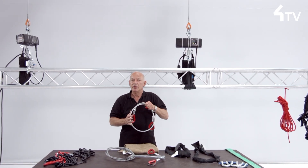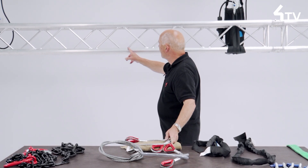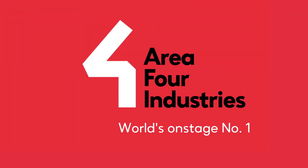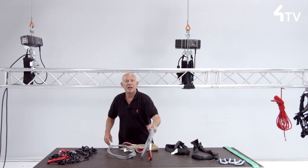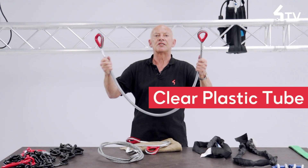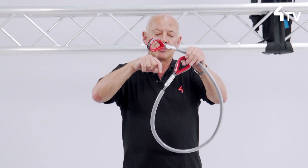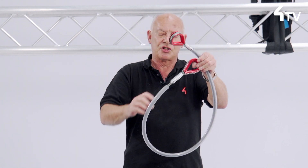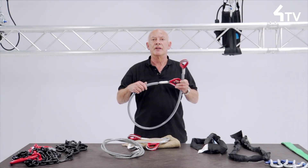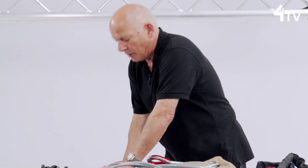If used to sling flown aluminium structures, the hard steel of the sling can easily damage the soft aluminium of the truss. Many people use a clear plastic sleeve to protect against this, but this practice is forbidden in certain countries because of the increased risk of trapped moisture causing corrosion and increased difficulty of inspection. These plastic sheaths are not good enough protection against a sharp beam edge.